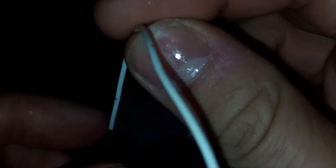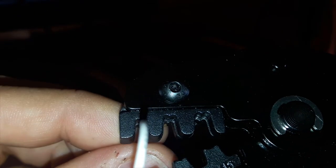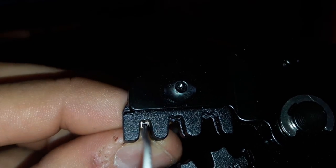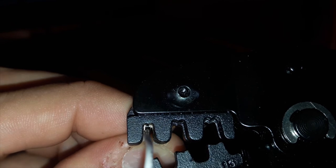Now that the wire is more or less safely attached to the connector, you can flip the whole thing over and hold it by the connector with the wings facing away from you. Grab your crimping tool, insert the connector, press the wings into the M-shape, and slide down until the wings hit the edge. Give it a last check, and when everything is positioned, crimp.